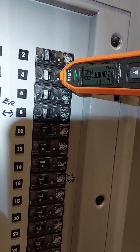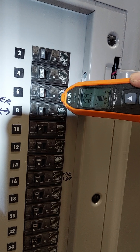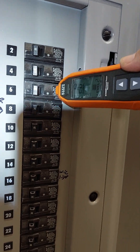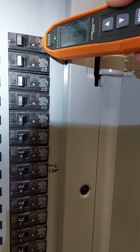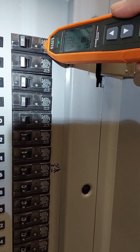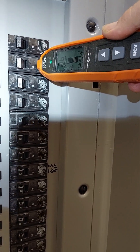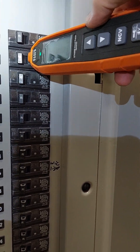You can see here — the lower you go, once I move down one breaker, you can just see the signal drop. That's how we know for sure that's definitely the breaker. The lower you go on that level, you should get less signal, and the closer you get to it, you should get less on the breakers beside it. Pretty much this tool is super accurate and works really well.